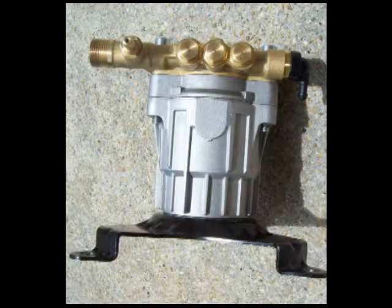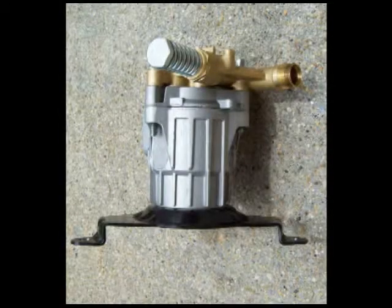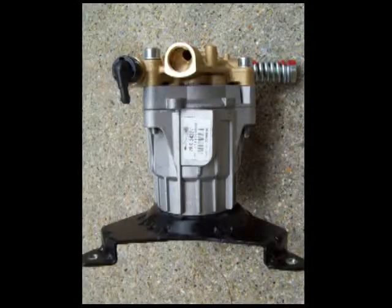This is some information on how to service and change oil in a Comet VRX2422V Vertical Shaft Pump. When I contacted Comet and asked them how to change oil in this pump, they really couldn't give me a lot of information other than it held 5 ounces of 30 weight non-detergent oil. I later found out that this pump is sealed for life, but if you're particular with your equipment like I am, you'll probably want to change the oil in it, and so I'm showing you a way to do so.